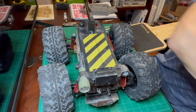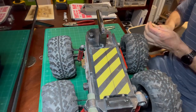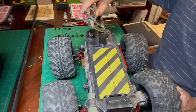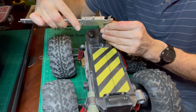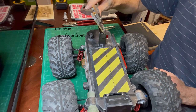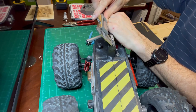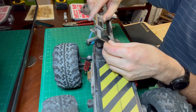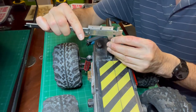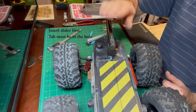The handle is a piece of three-quarter inch aluminum with a very long oblong hole on it. The hole is 19 millimeters by 7 millimeters. It is from the front of the metal part — not the cap, but from the front of where the metal begins — 5 millimeters back. Handle handled.